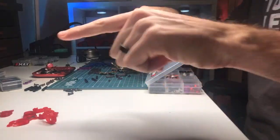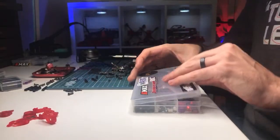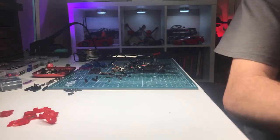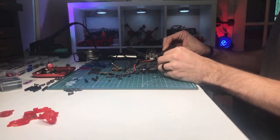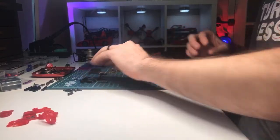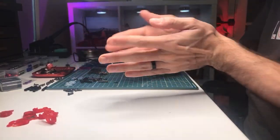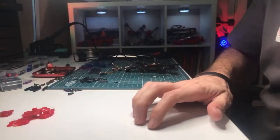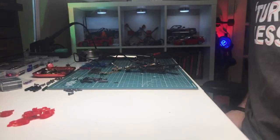Ripsqueak 3-inch. Okay, Kind FPV, great question. 3-inch propellers, in my opinion, need a minimum of a 1306. That is the minimum size motor to really turn those props with enough authority to get you a good PID tune and something that reacts really quickly. But the 1306s are only really going to work on a lightweight 3-inch build like this one, an all-up weight around 180 to 200 grams. If you're 200 grams plus, you're going to want to start jumping up in motor size. We're talking 1407, 1506, 1507. They're going to do better on the heavier weight, such as the Acrobrat, which is 250, 260 grams all up. Those bigger motors are going to be required to really move that around comfortably. You're looking for 4,000 to 4,300 kV or so.